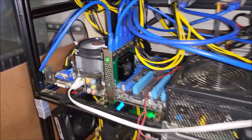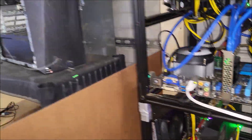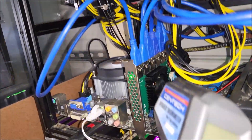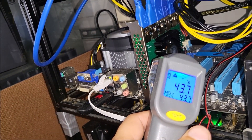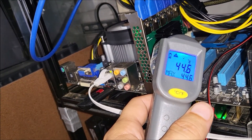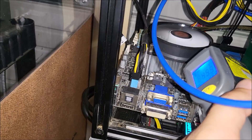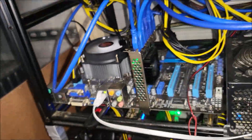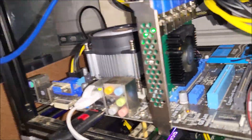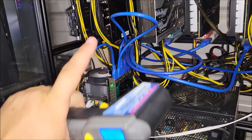So we've got it plugged in — there's a little green LED that comes on and the fan is on. It's been running for about 15 minutes or so. I checked the heat sink temperature with a thermal gun: 43°C on the front. The back side of the PCB was about 46°C. So it's running about 10 degrees Celsius lower than without a heat sink. I guess anything is better than nothing.